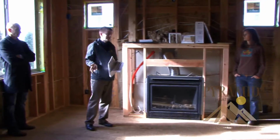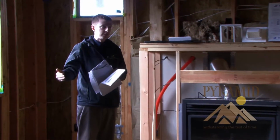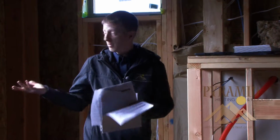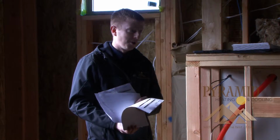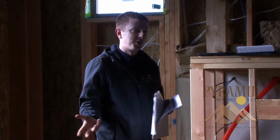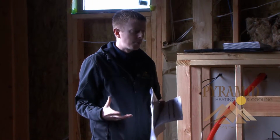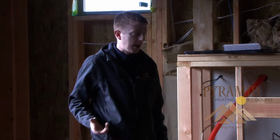Yeah, not to get too technical, we use an ASHRAE 62.2 controller. Long story short, it looks at the ventilation rate the house needs. It has an on-off switch. So we recommend it always is on. If there's a circumstance that requires not so much outside air to be pulled in, you can turn it off for a short period of time. But with these houses being sealed up, you don't want that to be very long.